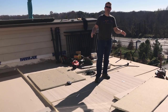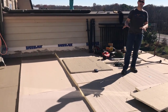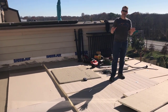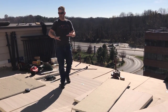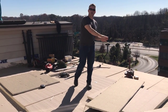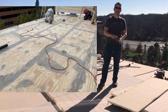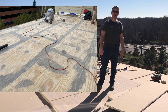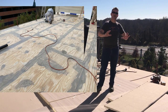Now we're installing the tapered insulation. If you remember, we had tapered insulation here before, but it was soaked with water. We also had plywood on top that was completely warped — the reason being it was square-edge plywood instead of tongue and groove. So after we get this quarter inch per foot slope tapered insulation on, we're going to put a three-quarter inch tongue and groove plywood decking on top of it, install that with exterior screws, and then we'll be ready to sand, put feather finish cement in, and install the Duradec membrane.